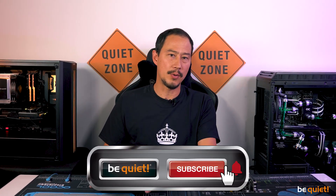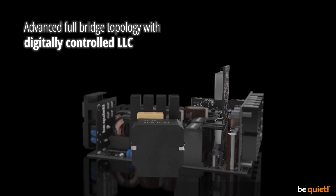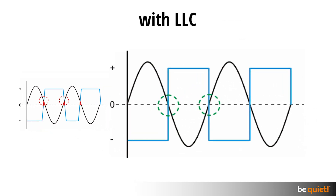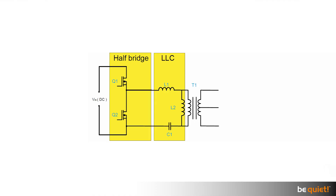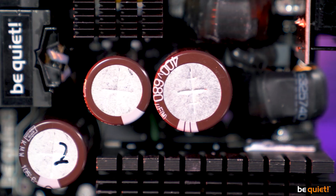Here's the problem in this wiring: if the switch is closed, a high amount of current runs through but no voltage; if the switch is open, a high voltage is available but no current. By rapidly opening and closing the switch, you have a very small delay in which current and voltage are available in equal measure. The LLC technology takes the rigid square pulse of the on-off switch and transforms it into smooth sine waves, with the polarity reversal happening at exactly the baseline. With this zero voltage and zero current switching, there is almost no power dissipation, and the resulting power is delivered wave-like — meaning it has to be less smoothed out later on, which means smaller capacitors.